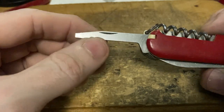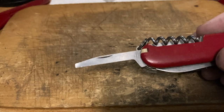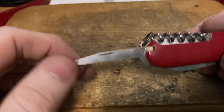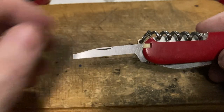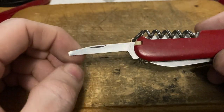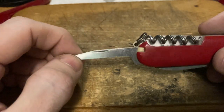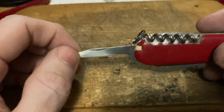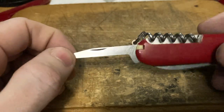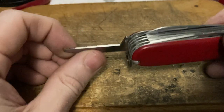As an electrician, a technician screwdriver is generally for doing terminals on contactors and stuff like that. It's where you have a lot of fine screwdrivers doing electronic work. Hence the term technician screwdriver. Usually they're going to be in a box or housing, and there may be electrical terminals around that you don't want to have your hands near. You don't want to risk touching or shorting something out. So having that reach is excellent.